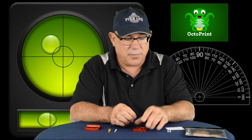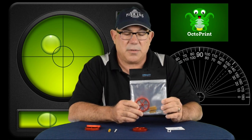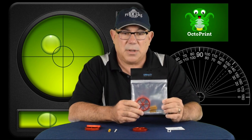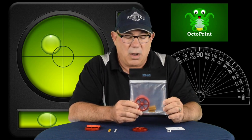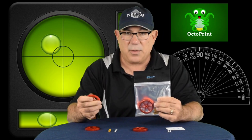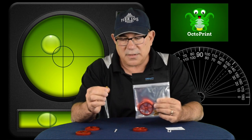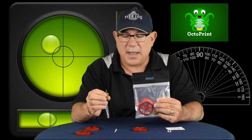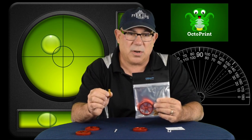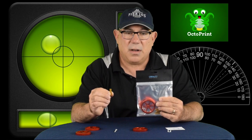We're going to upgrade our bed leveling system with this kit from Creality — there are equivalent kits for other printers as well. It comes with nice alloy wheels and a much stiffer spring than what comes with the Ender S1 Pro. That stiffer spring helps hold your level longer as the print bed moves and accelerates, since those vibrations can knock the bed out of level.